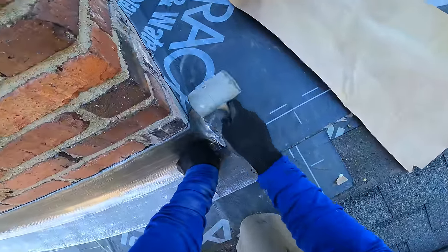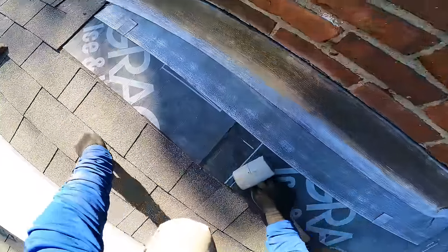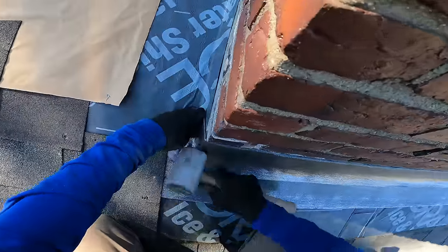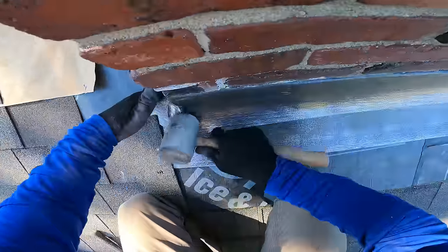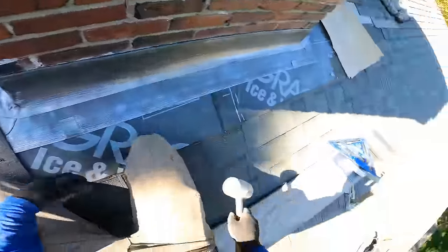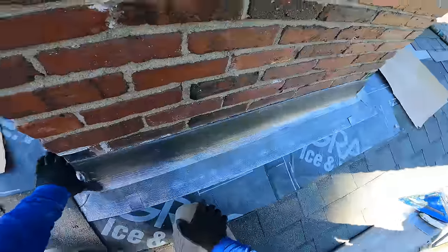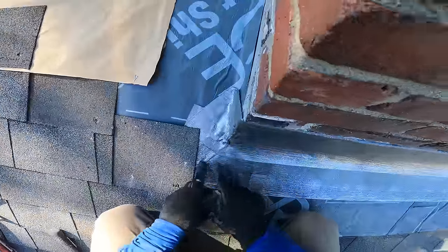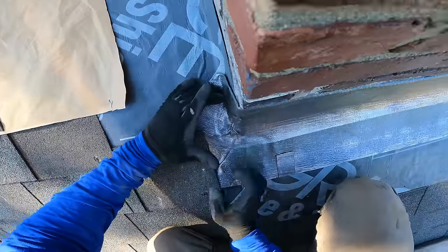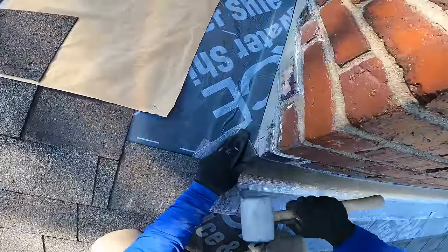This is how we build the corner. The traditional way doesn't get much coverage on this corner, so I do it a little differently for more coverage. I push this piece of lead down so it goes in like that, then bend that flap there. Get the corner a little crisper and go around with it slowly and gently. The lead will stretch but you've got to do it a little bit at a time. This is why lead is so great for flashing chimneys — you can bend it around a corner like this. There's no substitute without welding copper or something else. I came up with this bend after hundreds of lead jobs on chimneys and I get a lot of coverage on this corner.